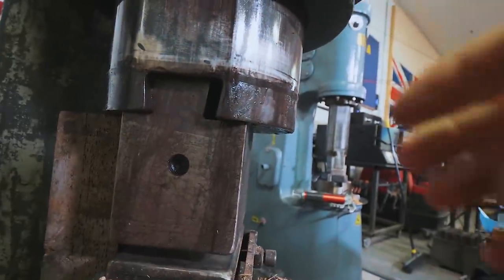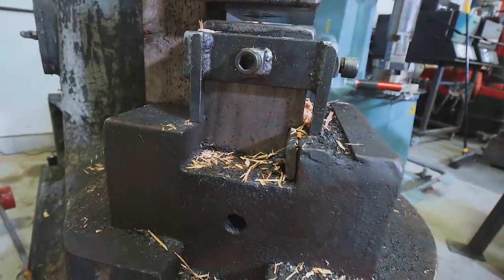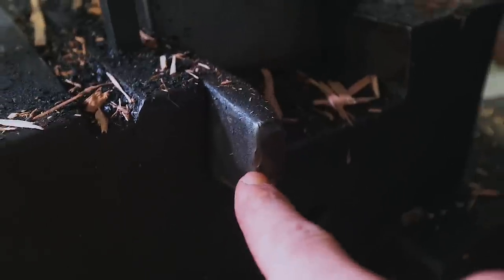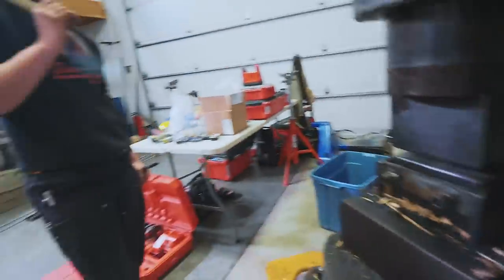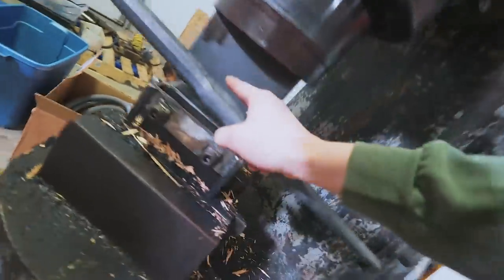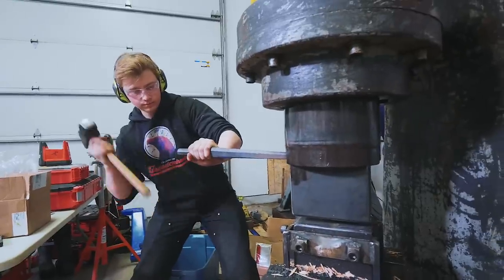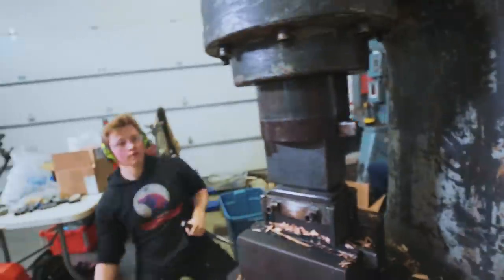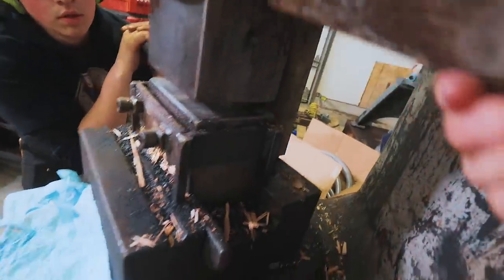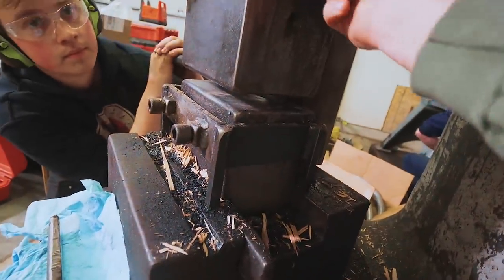The thing is, keys are hardened most of the time. What can happen is you can chip off corners of keys where they mushroom. If a hardened piece of steel chips off, it can be a bad time — an arterial bleed, a trip to the hospital, which is no fun. So right here, we have a mild steel drift. What we're going to do is use that to drive out the key for the top die. We can pull that off without damaging the hammer, chipping a key, and ending up in the hospital. There we go — get that key out of there by hand. Pull that key out.